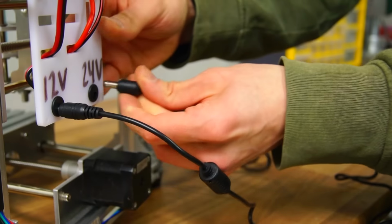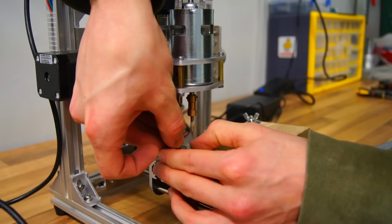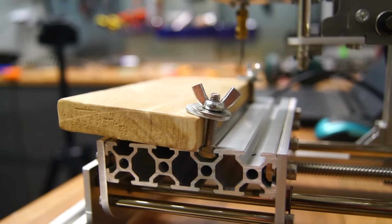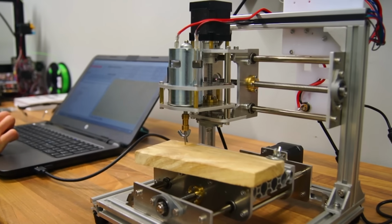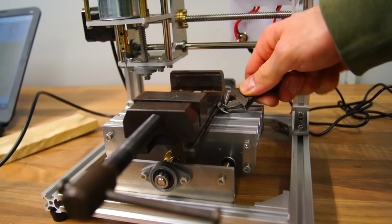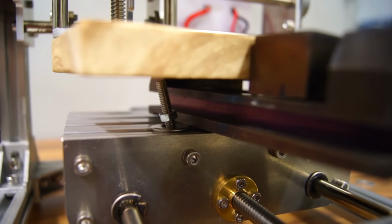Alright, I connected the power to each input, but here is where I encountered my first problem, and the issue was to lock thick objects to the bed. In order to cut out material, it has to be locked against the bed, especially if you are going to cut down quite deep into the wood. Whenever I would start the CNC, the vibrations and pushing power would knock off the object. Even using a small vise didn't help either. Surely enough, it got knocked off right away.